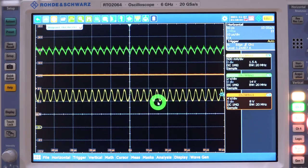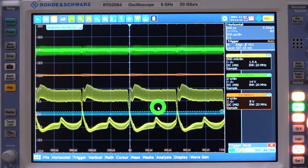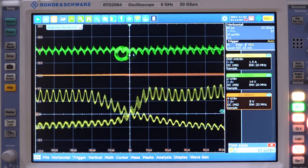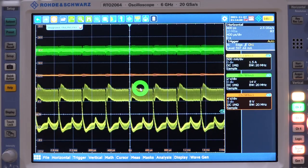Now let's make it harder: adding a 1 kHz square wave load jumping between 0 and 2 amps. Zooming out to see the full picture, you can see on the low side — no current drawn — very low input current, and on the high side, high input current. Zooming further in, that influence is also present at the output with some ripple change, possibly from noise coupling to oscilloscope cables. The SMU handles this quite nicely. Now changing the SMU output voltage live from 20 down to 15 volts, the DC-DC converter demands proportionally more input current each cycle, with the SMU providing fast rise and fall times to maintain constant voltage.